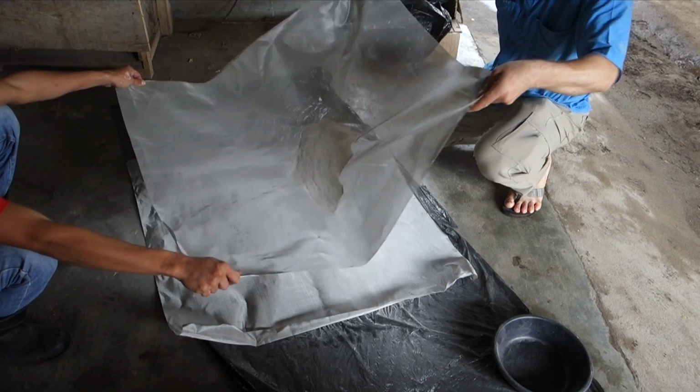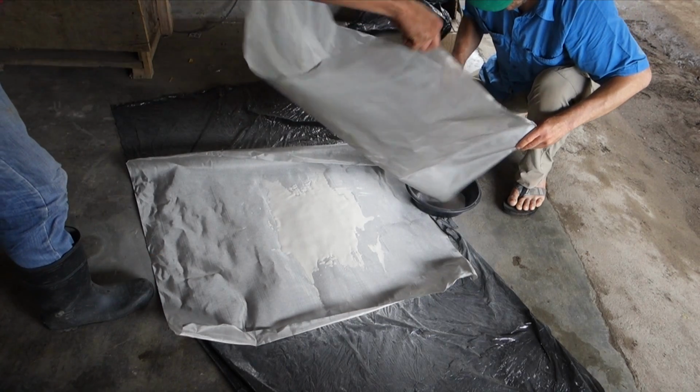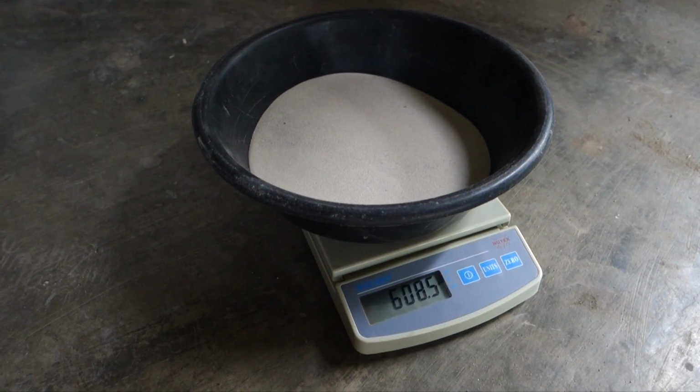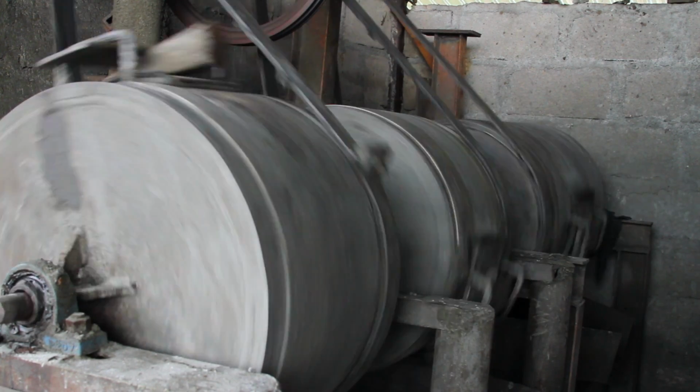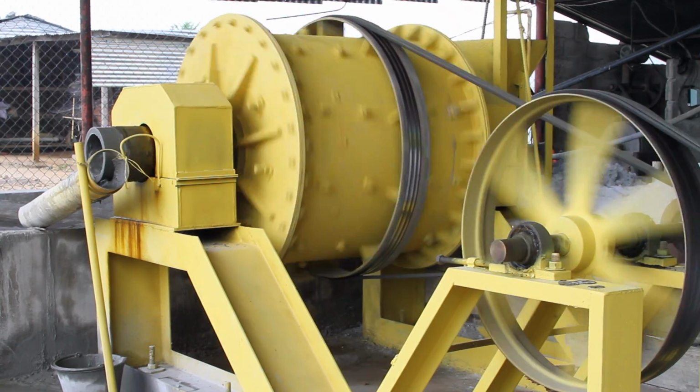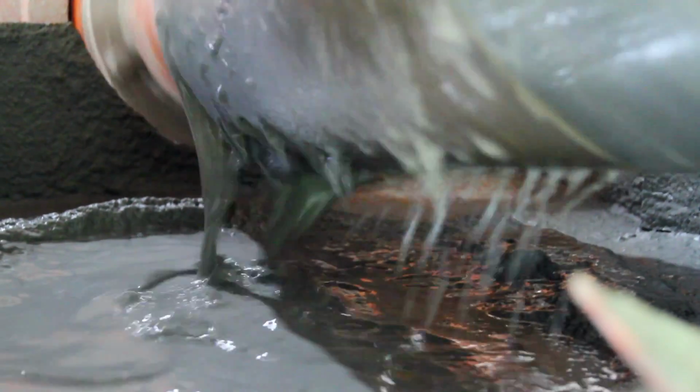The sieve that allows 80% of the ore to pass through it indicates the optimal size of grain. If you change mills, make sure that you mill for just enough time that 80% of the ore passes this optimal mesh size, and you will know that you have optimal gold liberation.